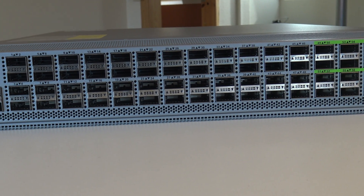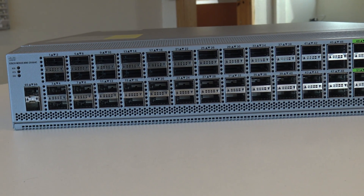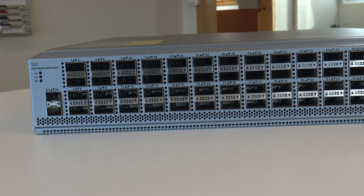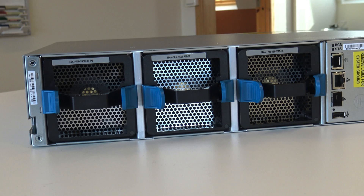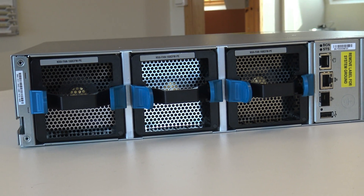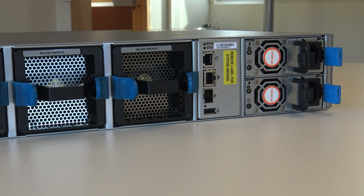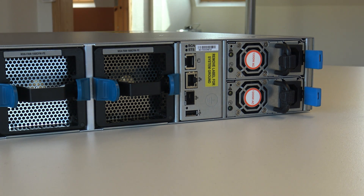As you can see, all ports are QSFP — the bigger SFPs — and that's to support 40 and 100 gig. On the backside, we have three fan trays. We also have two power supply units. And then we have the management and also the console ports.